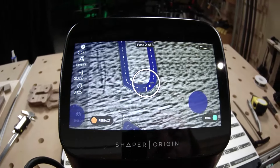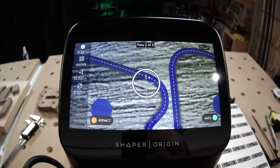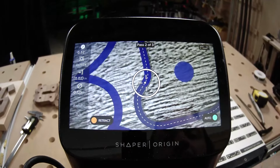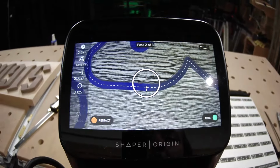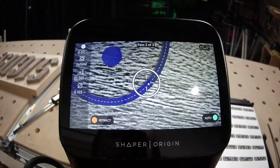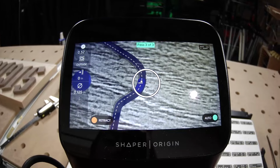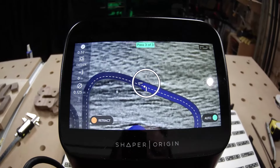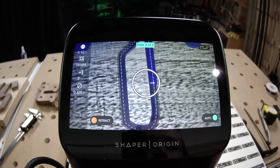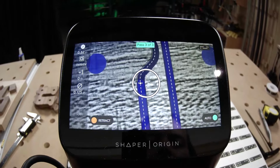And there's no limit, again, as long as you feel like you've got good, secure control of the tool and you're making nice, smooth cuts. You could go even deeper than that. It also depends on the material. This is a hardwood. We're cutting both along and across the grain. Cutting across the grain can be difficult. I know that we've got a nice sharp router bit here. When your router bit is dull, you might feel a lot more resistance, and that might impact your cut settings. There's a lot that goes into it. But the rule of thumb, if you're just starting out, should be about 1 bit diameter per pass in depth, up to 8 millimeters.